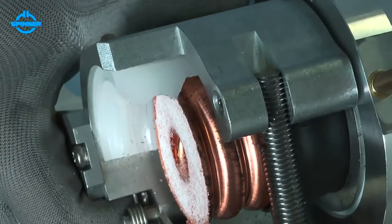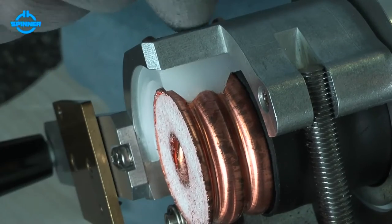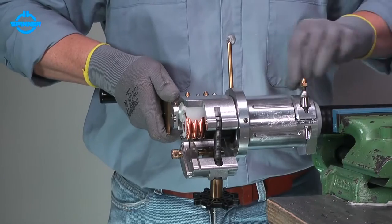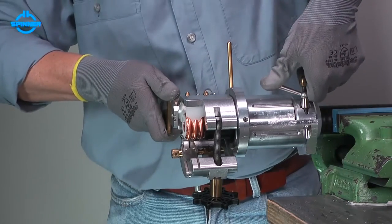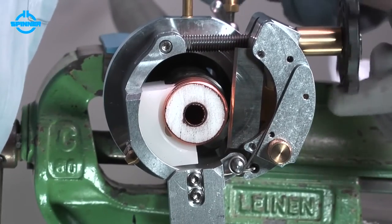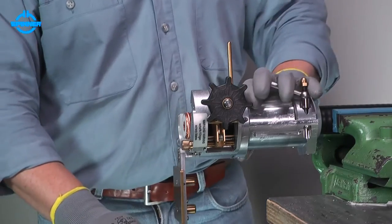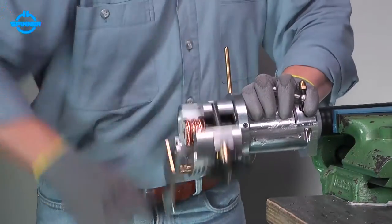Place the collet guide of the trimming tool in the corrugation nearest to the trimmed jacket. Close the clamping lever to fix the trimming tool to the cable. Turn feed handwheel counterclockwise manually until the blade is situated close to the cable. Cut outer conductor by turning the crank clockwise.